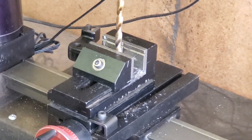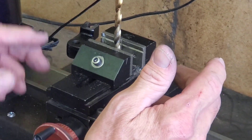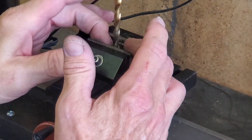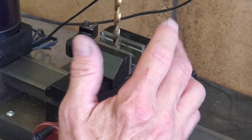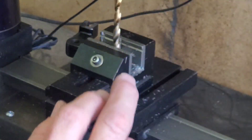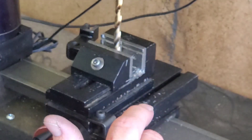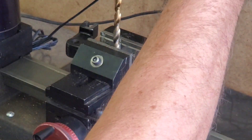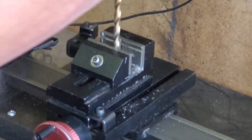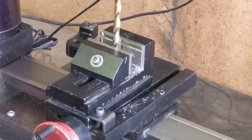We're centered back up on the part in the SureLine system. I put it in the way I was originally thinking — I probably should have pressed it the other way around because one end already had basically a center. So I'm working with the centered end; I've got it in the V-block setup with the little V to hold onto it. Again, it's been done by eye because we have a tapered casting with a non-centered hole on one side and pretty much centered on the other. That's a quarter-inch drill — drills aren't as accurate as mills, but we'd like to end up with a quarter-inch hole.